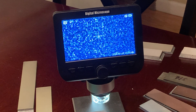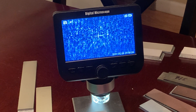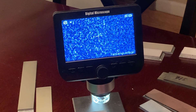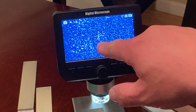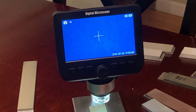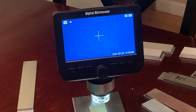So this is an 80-grit stone, or 200–160 micron. Under the microscope you can see a porous type of bond with the abrasive sitting on top of and between the pores. Now let's contrast that with a 3000-grit stone made by the same company. You see the pores are getting smaller, but the bond is still jagged — versus what you were seeing with the diamond matrix, which doesn't have a jagged bond. It has a very smooth resin.